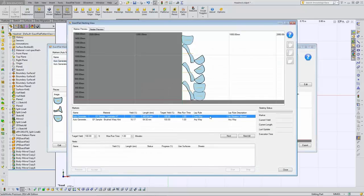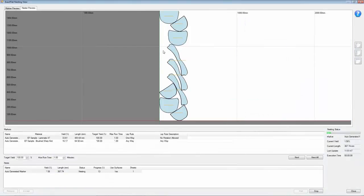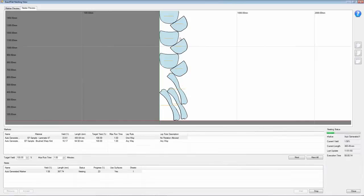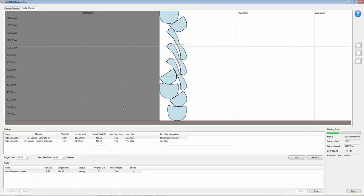And we'll enter into this workspace and we'll go ahead and just optimize this just to see what happens. You see the little tick marks in each little pattern component, I hope. Maybe if I have to enlarge this a bit, it may help those working on a smaller screen. These lines represent the grain line. Well, by default, we put those on the x-axis after we flatten them. And that's not exactly where they need to be. So how do I accommodate this?